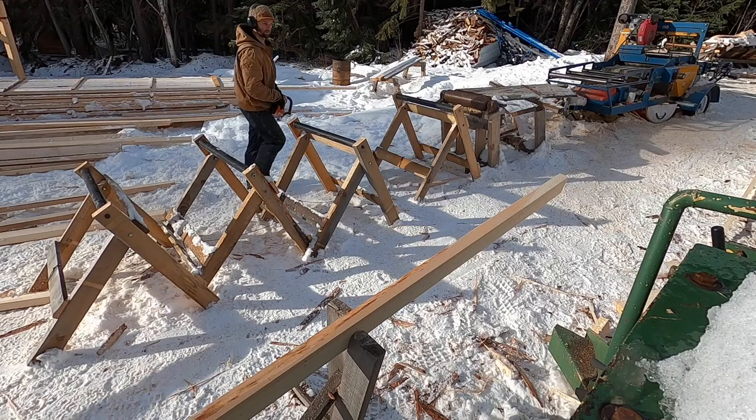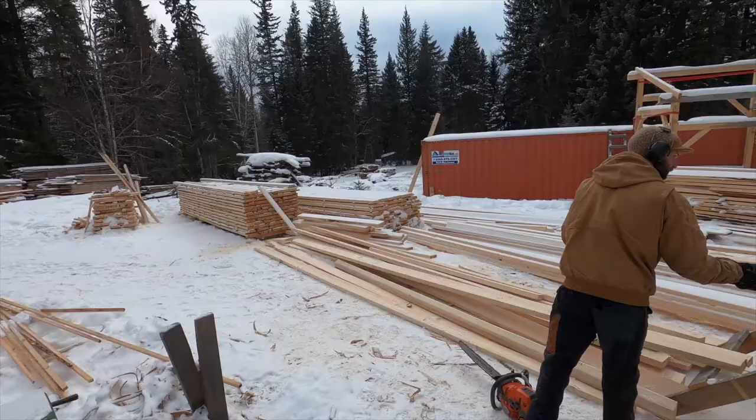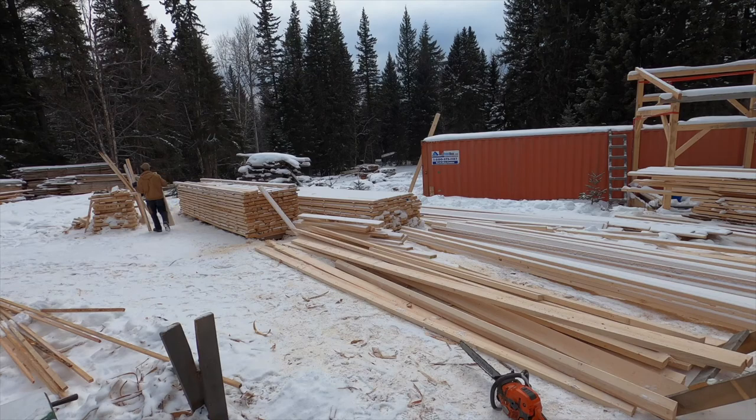Grading the lumber is one of the more challenging parts of this manufacturing process. We have a variety of specs. Grain has to be narrower than 1/8 of an inch. Grain angle has to be within 15 degrees of straight up and down. Minimum length is 5 feet. We can have knots between spans of 5 feet, but I often cut them out.